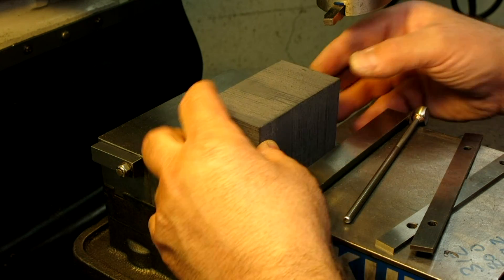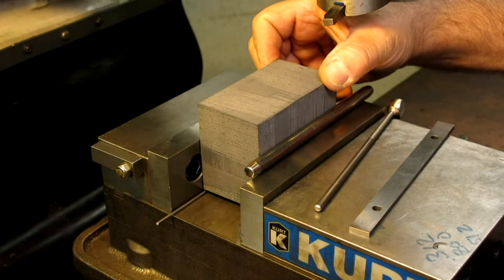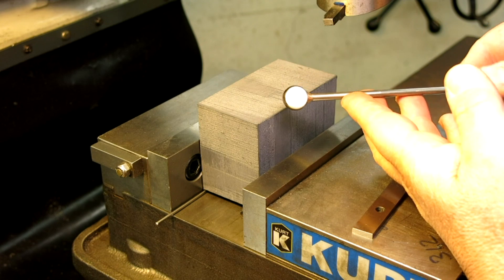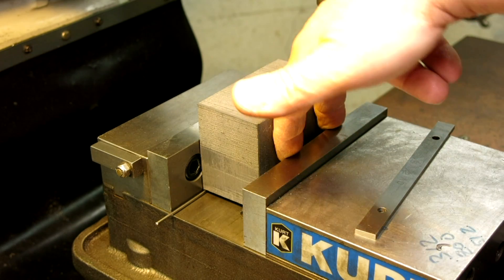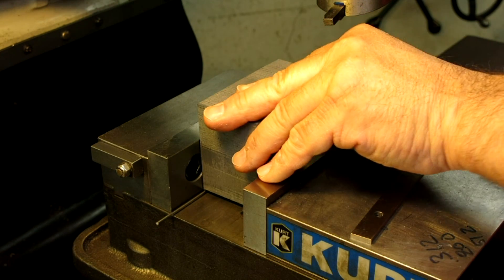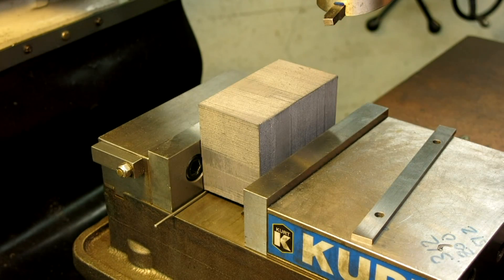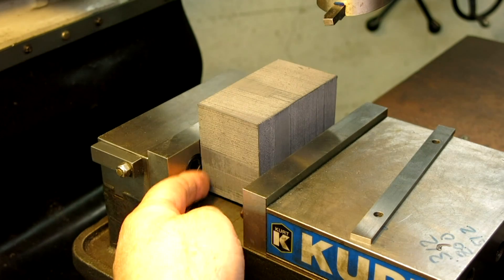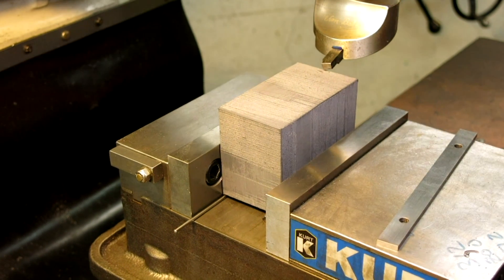I'm going to use my little rod in there again, and now it's going to become more important. Drop this in there like so. You can use a ball too if you've got really erratic stock — this one's just on a stick to make it easier to position in there. We'll probably use that a little later. The idea here is this rod is tilting this on the back pivot and pushing it up tight against that vise jaw. That's really what I care about right now — I want to be up against that vise jaw in a good way. So now what we're doing is we're going to create our first perpendicular surface, and then we'll go check it.